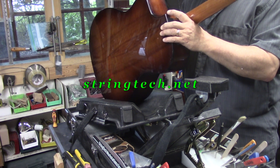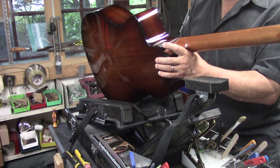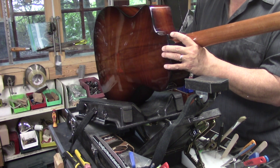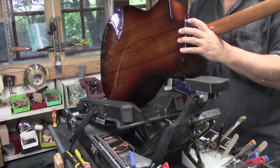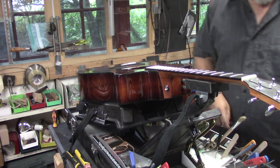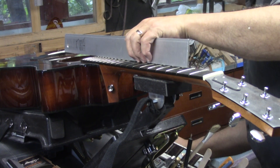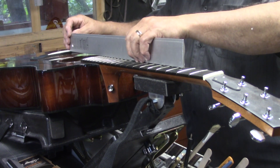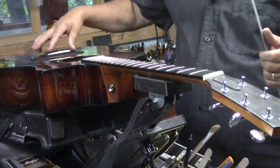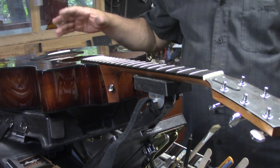This mechanical neck joint allows me to gradually adjust that neck angle bit by bit. Both bolts are finger tightened just to get a read on what this neck angle is going to be. I'll use a straight edge to give us an accurate read on the neck-to-body angle. When I put that straight edge on there and slide up to the bridge, it just about kisses the wood of the bridge — best case scenario. We got it bang on the money that first time through. There's now plenty of real estate in the height of that saddle to put the action anywhere we want on this guitar, and we'll triple check it for intonation as well.